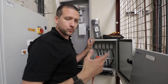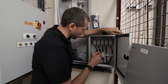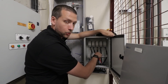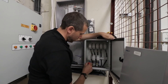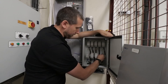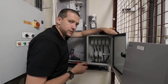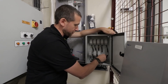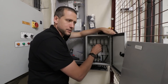I'm just wrapping up at the end of the day. This is the little cabinet I was on about — all the contactors are now in. Those are all the feeds which go up to the hobs and ovens. I've left the earth disconnected for now because I'm going to put a floating earth bar in there and one down here, then link them together. I've left space on the end because I've got to put another contactor there — that's going to be the interface contactor for the Paxton system. When they swipe the Paxton card upstairs, it'll energize that contactor, which will then energize all of these ones. So it's like a main contactor for all the sub-contactors.